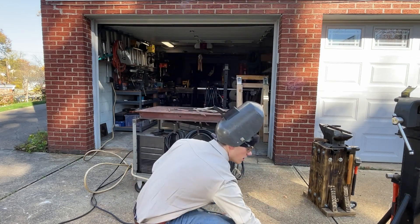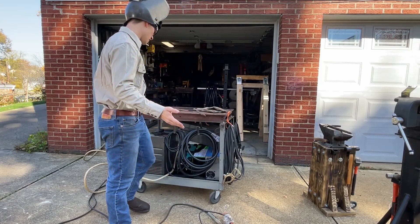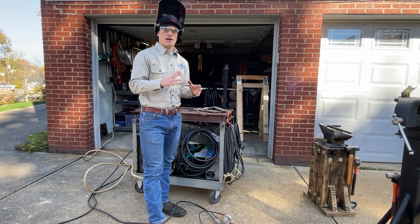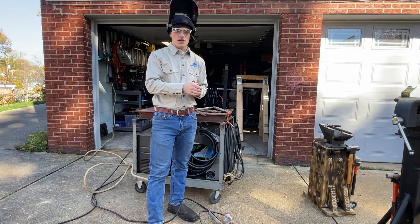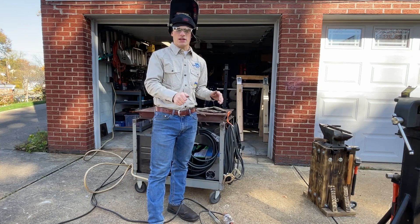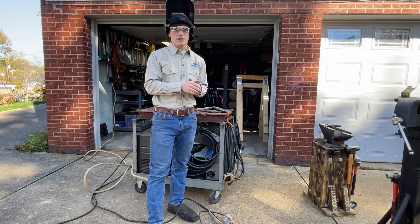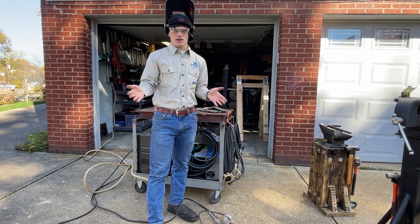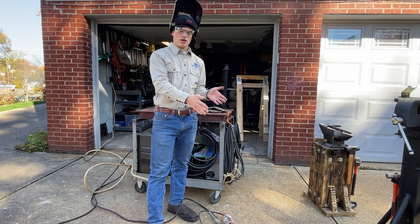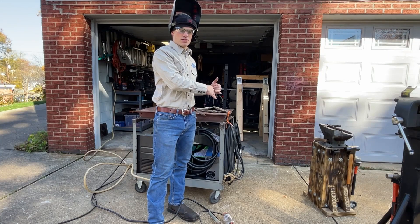In terms of heating, the carbon arc torch is amazing — you can't beat the price and the convenience. But in terms of cutting, your best option is going to be a plasma cutter. I got a Bestorch 7th gen for maybe 250 bucks — it works great, universal consumables, and has a pilot arc. I learned from Pete's Tools but there are a million videos on plasma cutters on YouTube. I would not waste your time cutting with the carbon arc torch — it's pretty much for heating. So: oxy-acetylene torch can heat and cut; carbon arc torch is for heating; plasma cutter is for cutting.